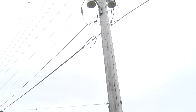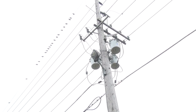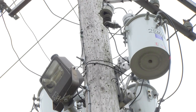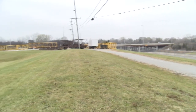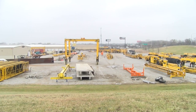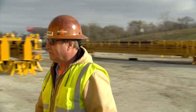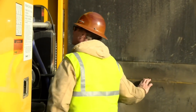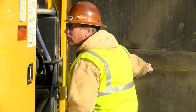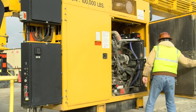Read all safety decals and be particularly aware of the messages earmarked with the safety alert symbol indicated on the equipment and in your operator's manual. Operating in the vicinity of overhead electrical power lines presents an extremely dangerous situation to all personnel in the area of the crane. High voltage can discharge through the crane even without direct contact with the crane itself. It is critical that you observe all safety codes, regulations, and clearances concerning power lines or other power sources as referenced in your operator's manual. Remember, safety, in most situations, means simply using your common sense.